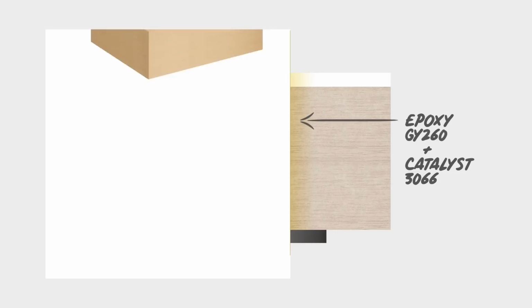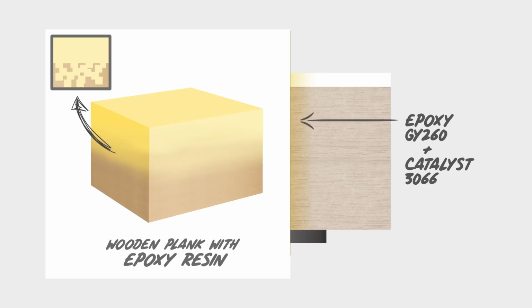Why we did that is typically the screw is the piece that brings water to the wood. With time and movements, the water flows to the hole through the screw, and the wood absorbs this water, grows fungus, bacteria, and the wood gets rotten without you knowing.